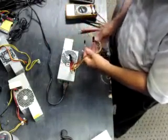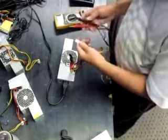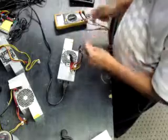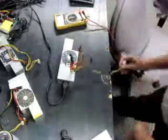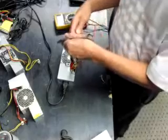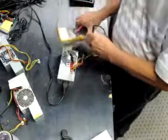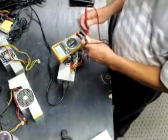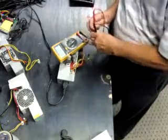That's unfortunate. I was hoping that this one would work because I have it ready to go into a customer's machine. I bought it in good faith from a seller that I thought would have tested these. And we get nothing. We got no 12 volts — we should have 12 volts right here — and we got nothing. It's dead.